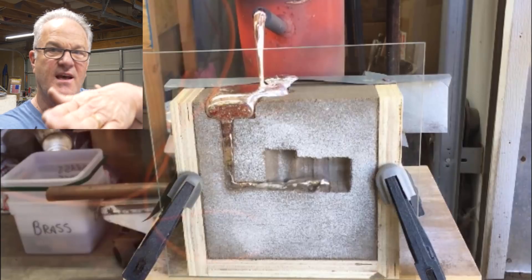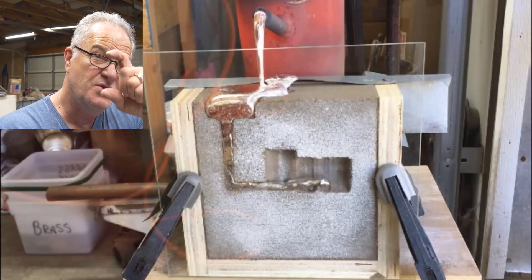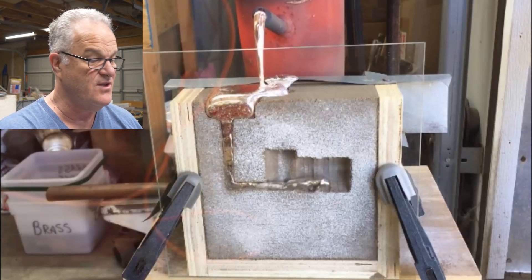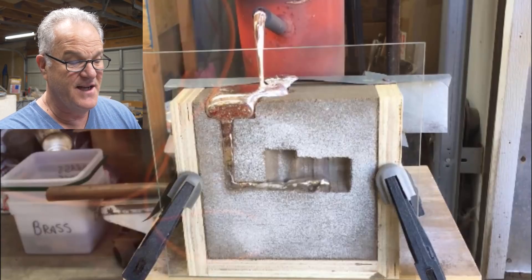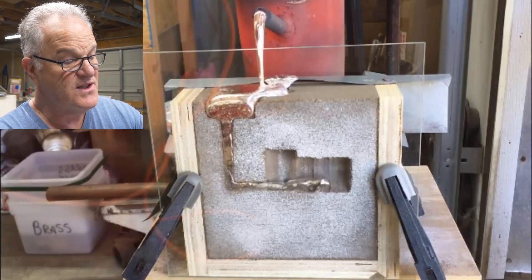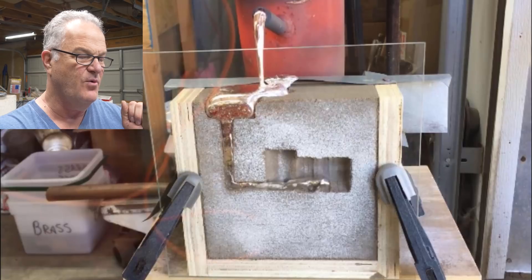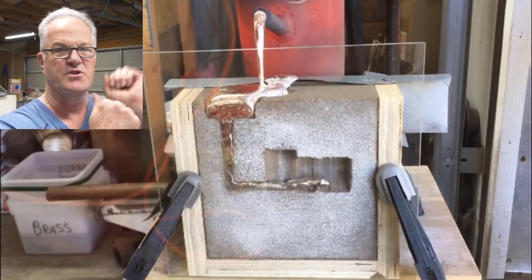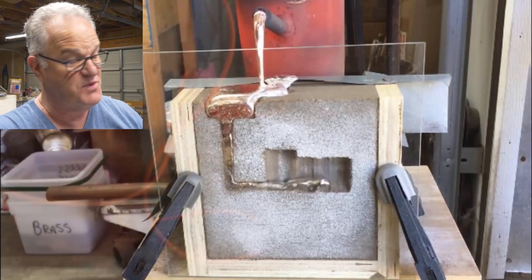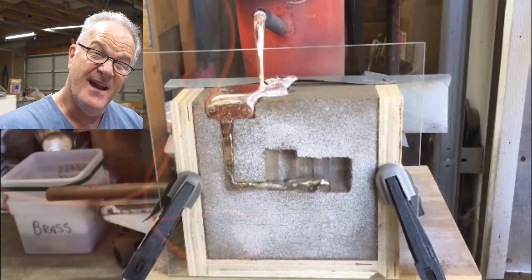The metal doesn't come in and do this straight — it comes across and then comes down into it. He's got a two-inch tall sprue, and look at how fast that metal is flowing through this mold. It is just racing through there. Now, this little thing of the metal launching out over — Campbell in his book describes that as jetting, where the metal is moving so quickly that it will come through something and jet through it, kind of have a stream of metal just flash out into space in the mold. The surge trap is going to help, but not that.